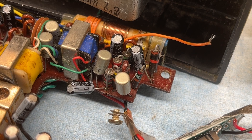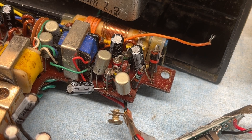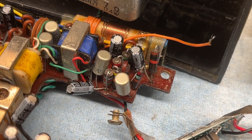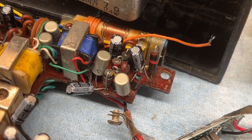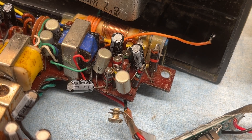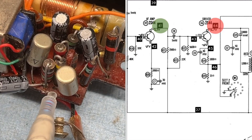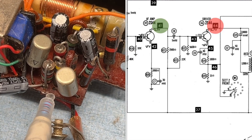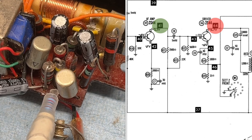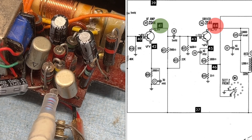After finishing the recapping, there's still a little bit of distortion — you can hear the hissing or rushing noise. I think we've just got a bad germanium transistor. I get the signal tracer out and go to the collector of the audio frequency amplifier. You can hear a little noise, and then if I go to the driver collector...